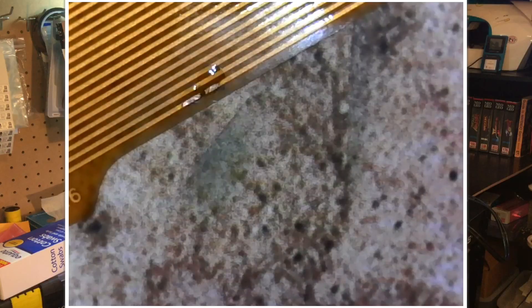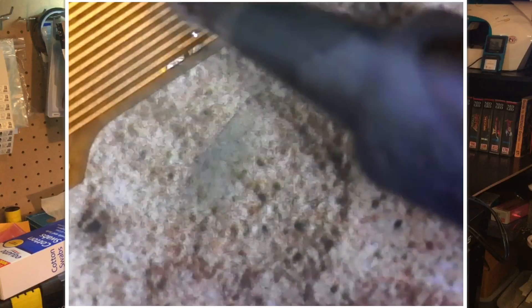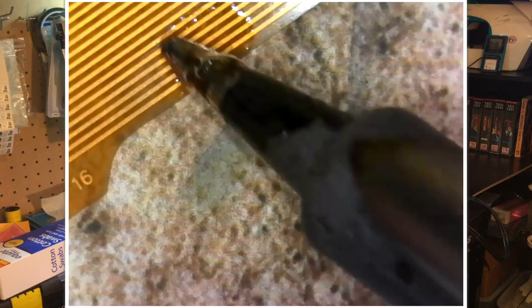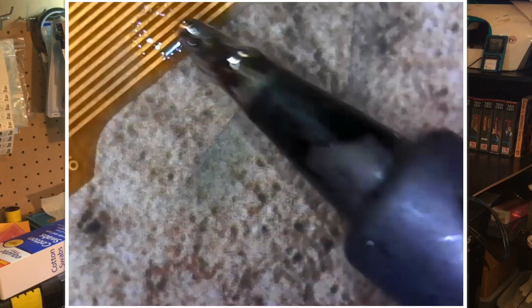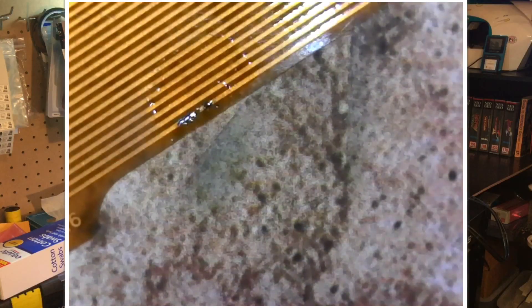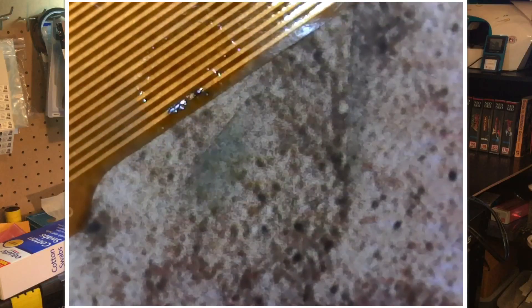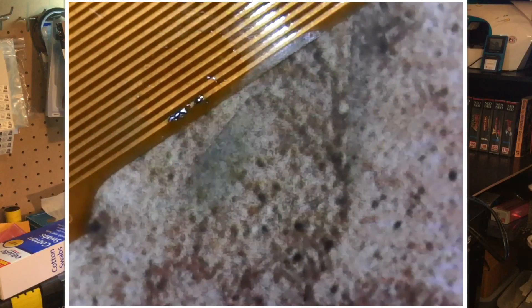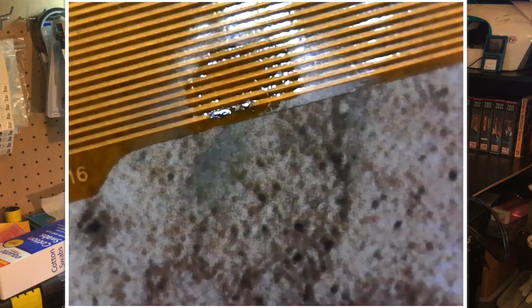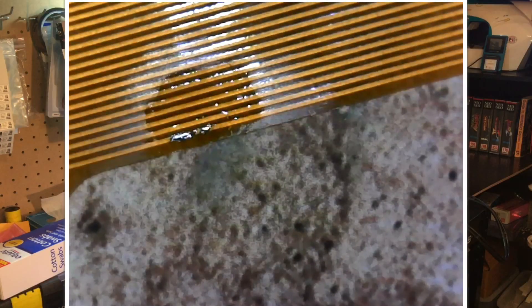Time to tin the trace — I'll grab my iron, got it around 300 degrees since it's a flex PCB; it can't take much heat, very thin traces. When soldering on something this thin, you're applying almost as much heat to whatever's underneath it, and you have to make sure it's not something that's going to melt. I'm using a ceramic drink coaster, which works perfect for this — so I keep a stack of them here on the workbench. Now it's nicely tinned and just waiting for our jumper.